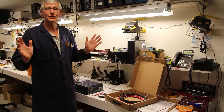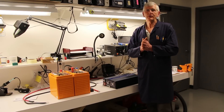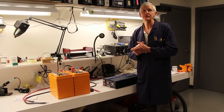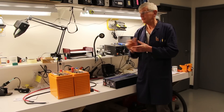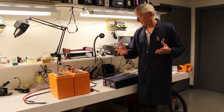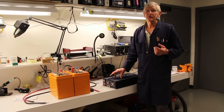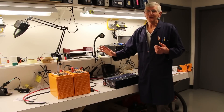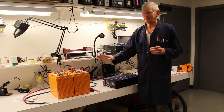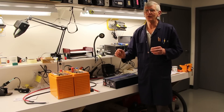That's all you need for installing the 1500 watt inverter to a battery. The battery bank in this case is a sealed AGM battery bank of 210 amp-hours. Two 6 volt 210 amp-hour batteries make a 12 volt 210 amp-hour battery bank. For the 1500 watt 12 volt inverter, you could draw up to 150 amps if you were using all 1500 watts — that's a lot of power. For a 210 amp-hour battery bank, you'd get maybe half an hour out of that battery bank to run it. So you've got to look at how much power you're going to use, what inverter, and how big your battery bank is going to be.